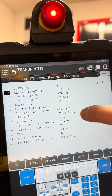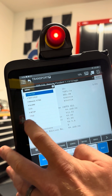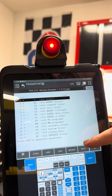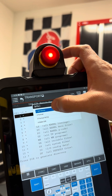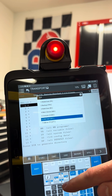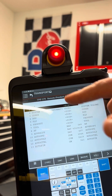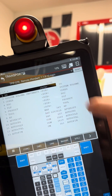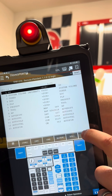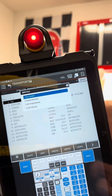Now press the Menu key, go to File, and it will pull up the file browser. I'm already pointed at UD1, which is good because my USB disk is in the door. If you weren't, you'd press Utilities → Set Device and choose where to point the directory. Mine is UD1, so I'll press Enter to see the files. I've already extracted all the files, so when I look on here there are 75 different files for this update, all in that root directory. Then go to the next page, press Install, and select Auto Update, then press Enter.